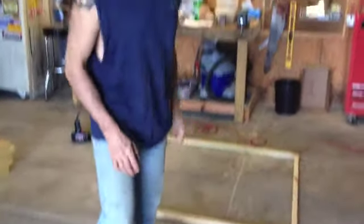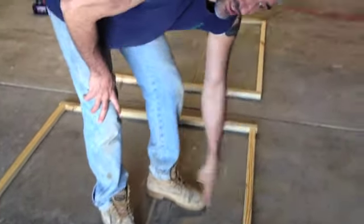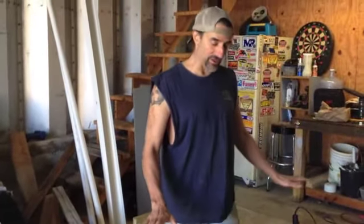The longer boards are 46 inches, the shorter ones are 43 and a quarter. For the uprights, we want to make it three feet high but pitch it a little — I picked three degrees. We're gonna cut two of the backs to 36 inches, two of the fronts to 33 inches. The bottom will be flat and the top will have that three degree pitch.